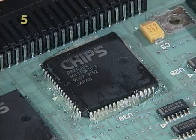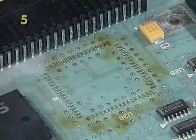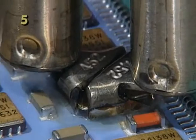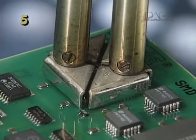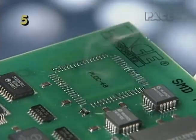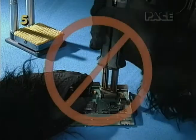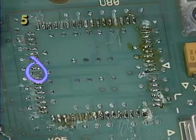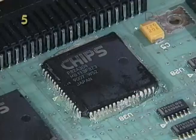The goal is to evenly heat all the solder joints to reflow in a rapid yet controlled fashion before lifting the component. Complete solder melt of all the joints can be observed visually or by the component yielding to a very slight movement.